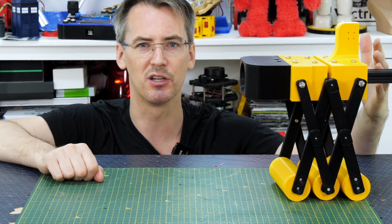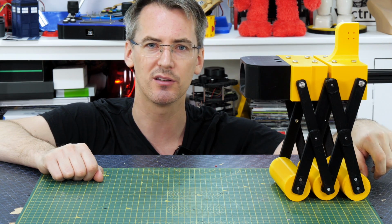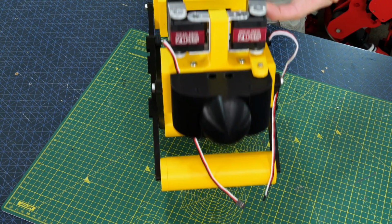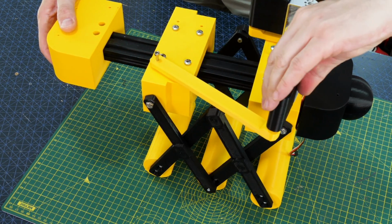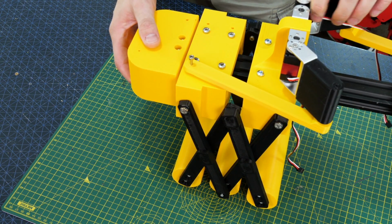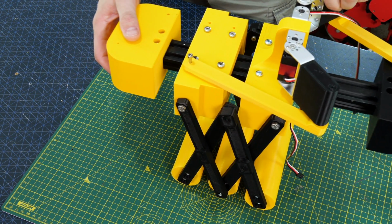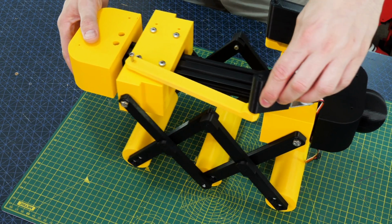So we just need to put some motors on there now. I'm planning to use servos, but let's hope they're powerful enough to operate those segments. I'm using 20 kg torque metal gear servos that I've used in a lot of projects, and they come with these brackets for building robots, and those are pretty powerful. One of those concertinas the whole thing up, and one drives it the whole length of that sliding rail. So that should give us every combination of motion that we need to make it locomote.